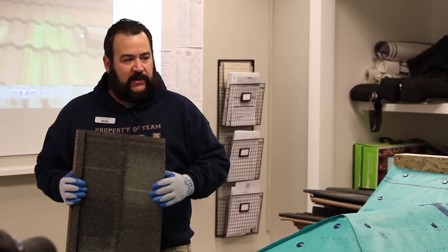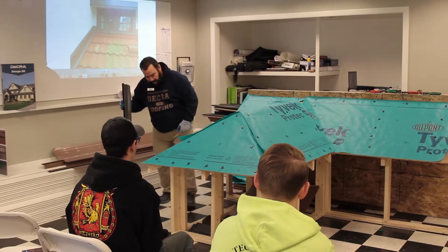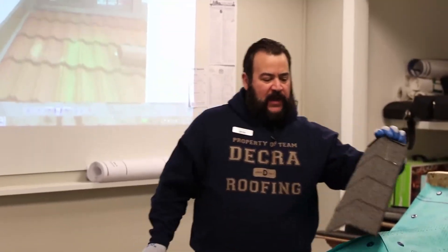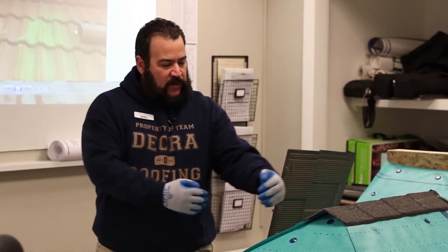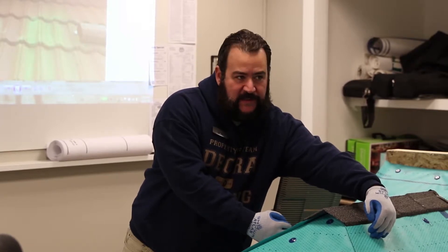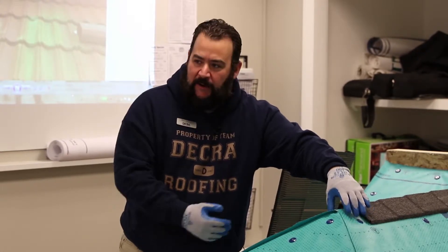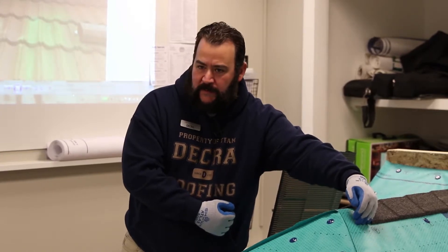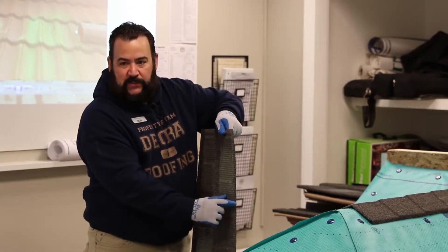Your layout is kind of important. I've seen contractors get into that situation, and because our cap might not be wide enough to cover it — we're working with a seven inch cap, so you've got basically three and a half inches that comes down on each side — some guys will take cap and either get some painted flat sheet and break their own, making it more of a standard 12-inch style cap. That's one way of saving your hide in that scenario, and it's going to save you a ton of money instead of having to cut off just a small piece of panel to finish it.